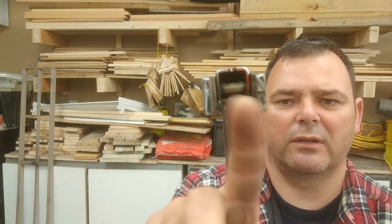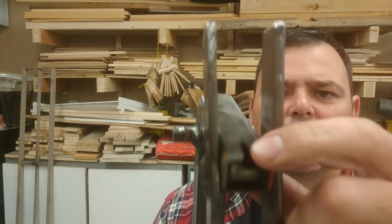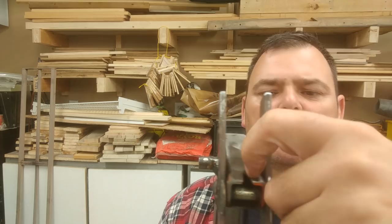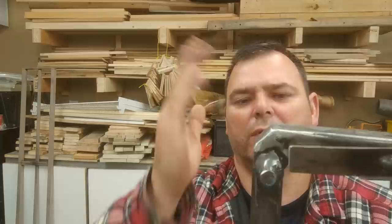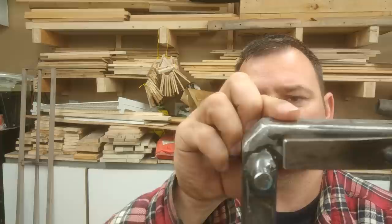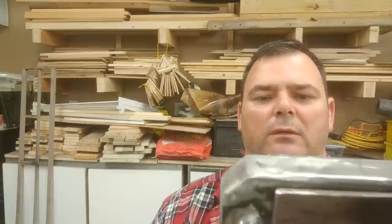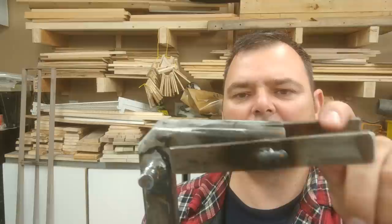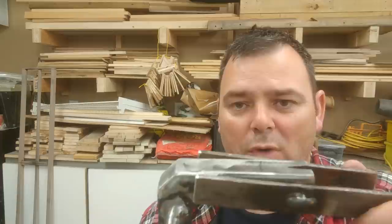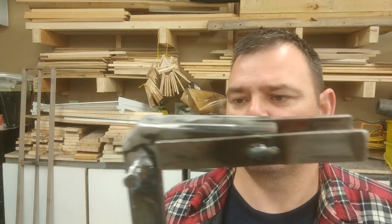At the end I'll put a flat bar to join the two sides and give it more strength. Off-camera I made a nail puller — it's basically a V cut with the grinder — and it worked great. I had to shave this part down because on some pallets the wood is much closer together. The pin location is really important because it removes stress from this joint. If all my pallets had three-to-three-and-a-half-inch boards I wouldn't have needed this, but since some have five-and-a-half-inch wide boards, that's why I created this longer piece.